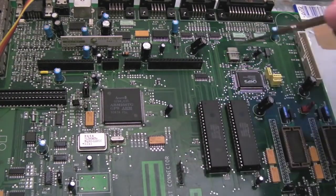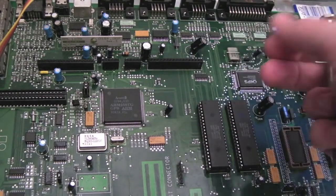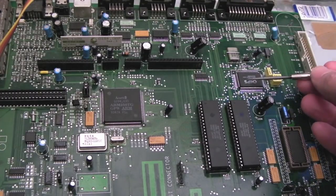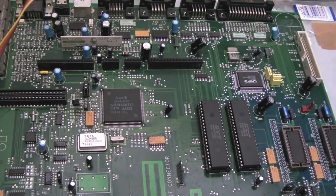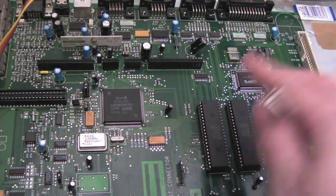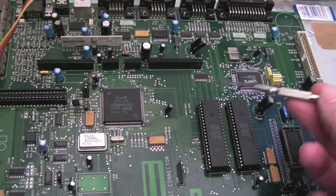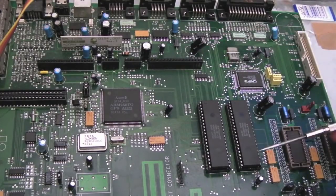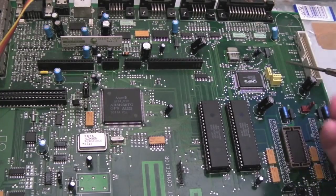What else is related to the floppy drive? It's when it accesses the floppy drive - because normally when it boots you'll always see the floppy LED come on, it goes do-do, then it boots. I think you get the sound after that, and that's the point where it freezes. The flickering is so high frequency it's not giving the normal diagnostic information as part of the boot - that is a fault. I was trying to look at what else uses the BD bus, because this connects up with the LA bus for addresses, the same as the ROM uses - it's the main address bus.